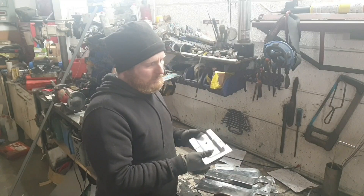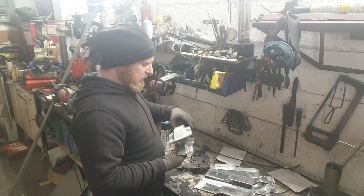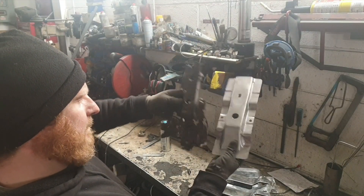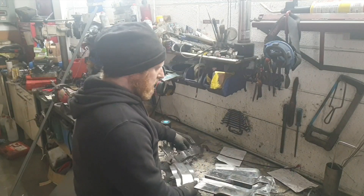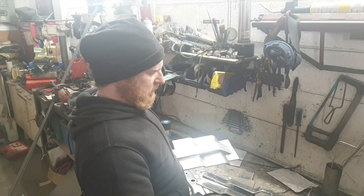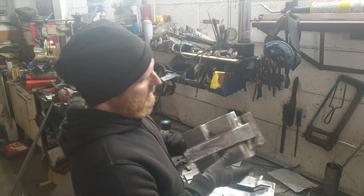That took a bit longer than I would have liked, but I'm really happy with the result. It's very professional looking — looks like a panel. The first attempt typically turned out better but was a bit narrow where the bolts need to be, so that's the replacement — or rather what it's replacing. This is the mould I made, the dies I made to do it. It's a fairly straightforward shape, mostly just straight lines and angles, no compound curves at all, so I was able to make it out of flat plate.